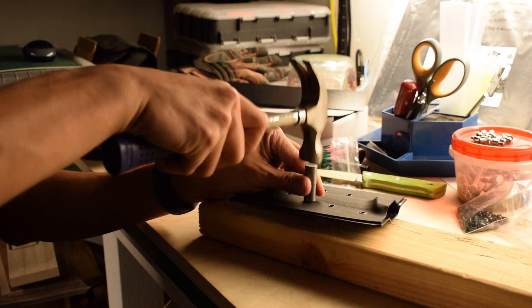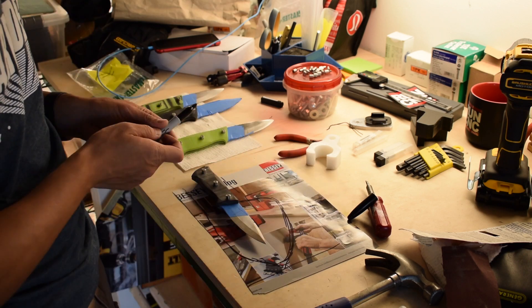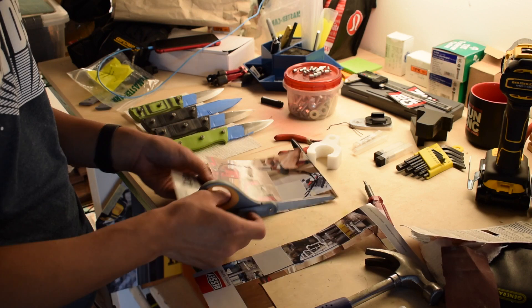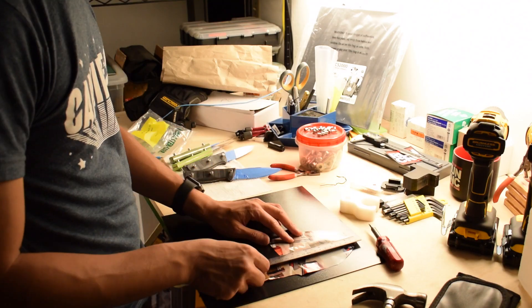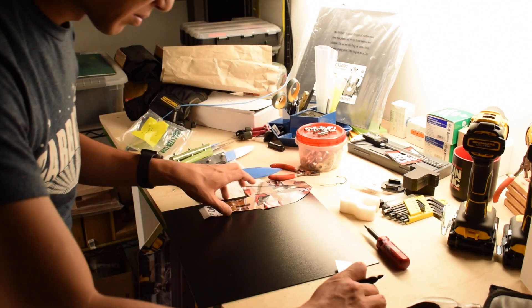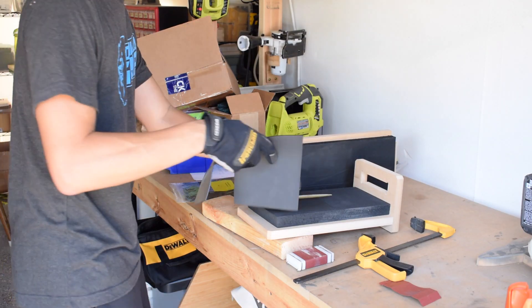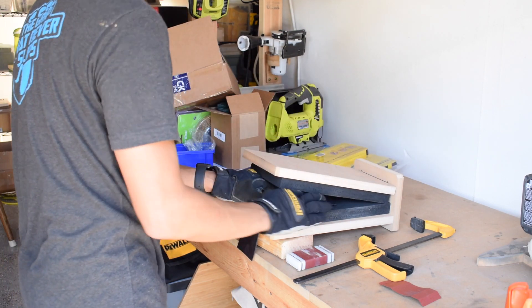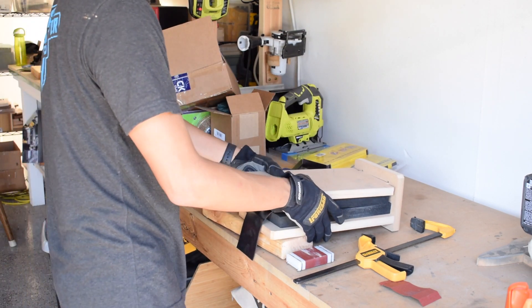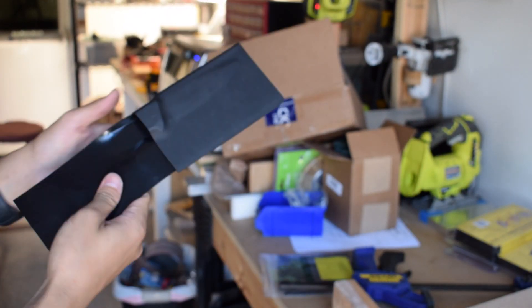Another sheath variation is a single piece folded Kydex design. Doing it this way also allows you to integrate a belt clip, something I picked up from Walter Sorrells — I'll link to his video in the description below. Using a paper template, I figured out about how much Kydex I needed and threw it in the oven. Once it was at temperature, I folded my knife inside the Kydex like a taco and pressed it together. It's important to make sure you pull the Kydex tight around the knife so it conforms against the spine. There were a couple of times where I wasn't thrilled with the final shape, so I threw the Kydex back in the oven to try again.